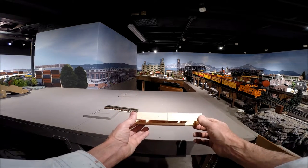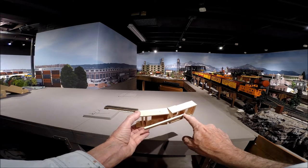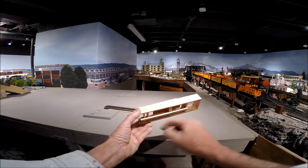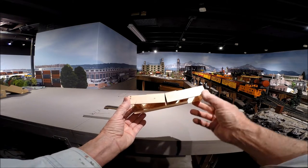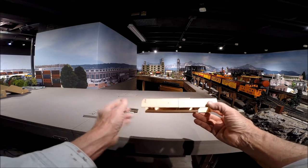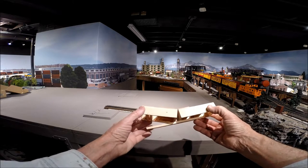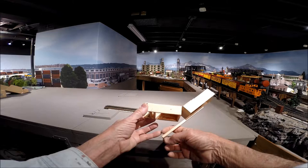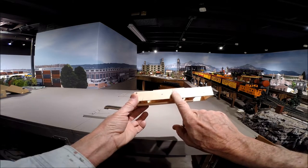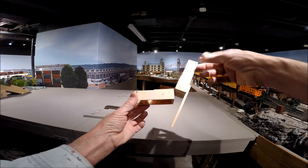And then basically what I ended up doing was coming up with a counterweight system here by designing and building a steel beam, a 1-inch by 2-inch wide beam that runs underneath the layout like that. The idea is it's mounted to the swing section permanently and swings free of the permanently mounted section of the tabletop. And on the bottom of this cantilever, I have weights that I mount. That weight basically balances against the weight of this 42x36-inch section of the lift-up swing-up table.